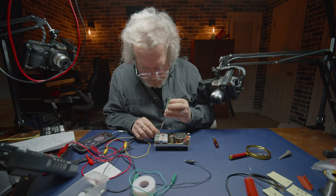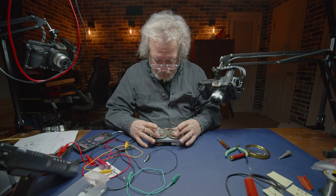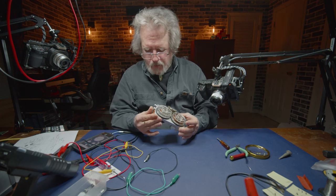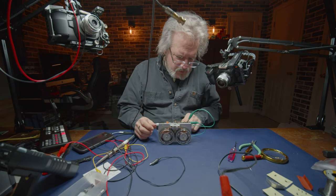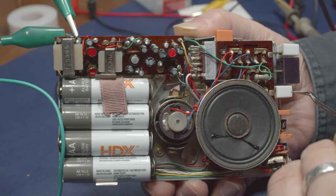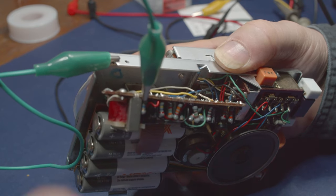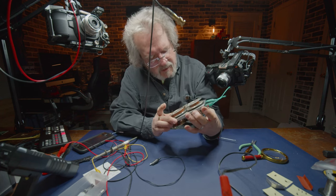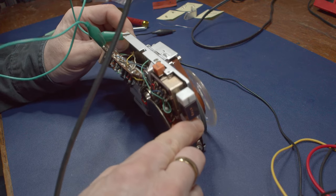We're really close on this - I have a good feeling. I don't even know what's on this tape; if I'm not mistaken this is the tape that came with this recorder when I picked it up 20 years ago. The question now is why there's no audio - it's behaving as though there's a loose connection. These wires are so tiny. I can still inject tone into the very input, which means something is not coming off the head.